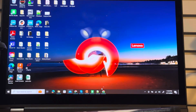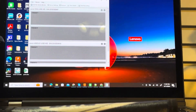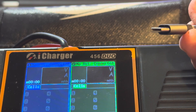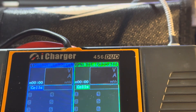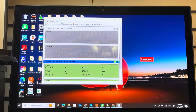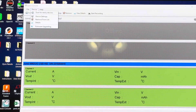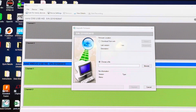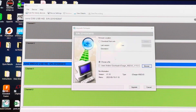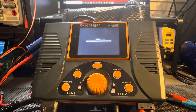So you'll click there and download the Junsi console software, and then either the 456 or 458 firmware — the firmware version you're looking for is version 1.10. Once you download the Junsi console, go ahead and install it. You'll need a USB-C cable — plug it into the USB-C port on the top of the charger. The Junsi console software will automatically pick up your charger when you plug it in. Then go to Device, then Firmware Upgrading, choose a file, browse your downloads, pick the 456 version 1.10 file, and click the Upgrade button. You'll watch your iCharger go into a boot where it updates the firmware.